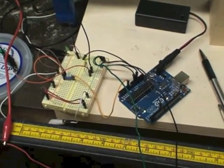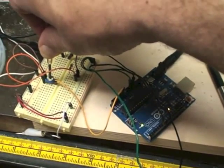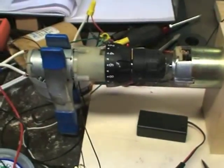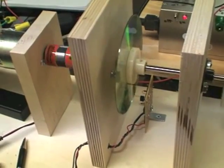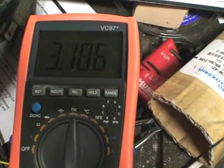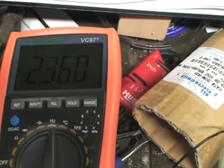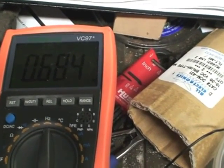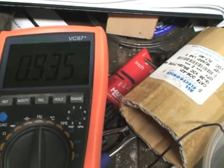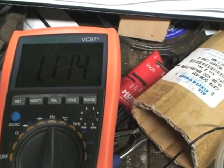The Arduino is on, the 12-volt power supply is on, and I'll start to dial up the speed with that pot. You can hear the whine of the pulse-width modulation in the drill motor. We get up to an appropriate point where the whole thing spins. You can see the pulse-width counter and the rotation counter running. The bar is spinning at a moderate rate — about 3 hertz. I can slow it down to about 1.5 hertz. It's not real stable, but at this speed you just need a point where you can get the wiring started. We're getting about one rotation per second.